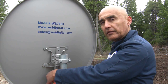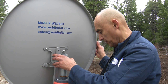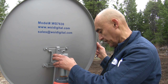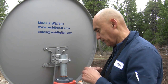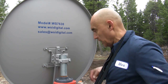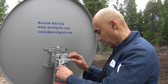I've peaked my elevation, sitting at 69-70. I'll make sure my azimuth is better — now I have 73%, 74-75. Looks like 75% quality will be the tops. I'll go ahead and proceed by tightening the nuts a quarter turn on each side on the clamp.